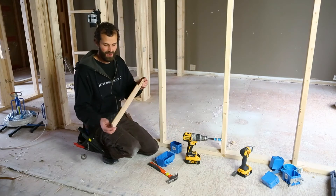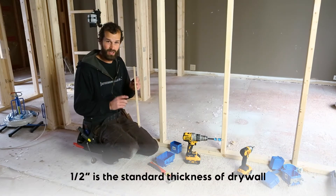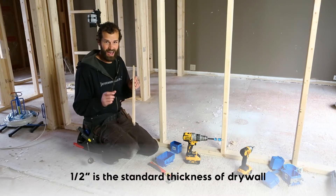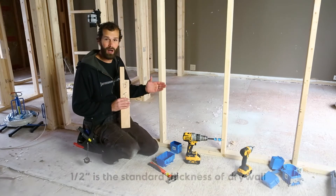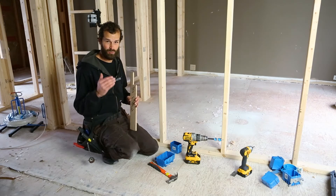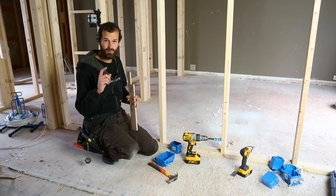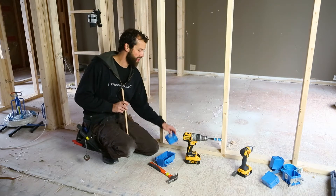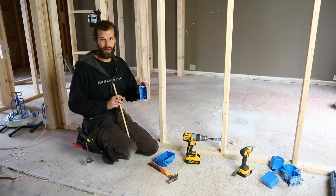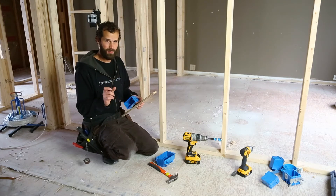Here I've got a jig made out of half-inch plywood. Half-inch is a critical dimension because residential drywall is half-inch thick, and I want to flush my box to the face of the drywall. So when I'm finishing out the project, the yoke of my receptacle — the mounting plate — sits flush to the face of my box. That's critical. I want a good, clean, tight fit. I don't want any slop in that receptacle.